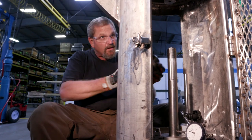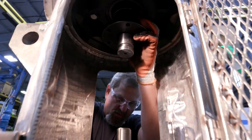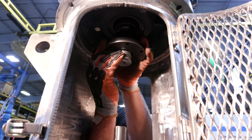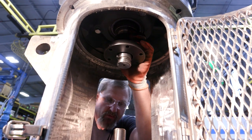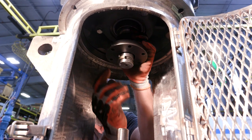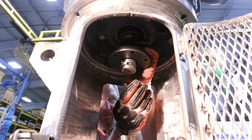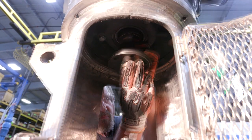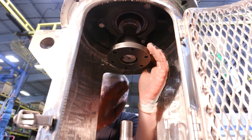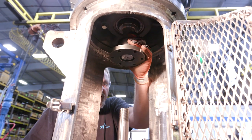The first part to assemble is the motor hub — install it so everything slides up freely. Install the motor key and get it started in the slot. You can hold the motor key in by turning backwards on that. Now take the split rings where you marked the X and make sure the X is up. Place one split ring over the keyway and then the other split ring with the X up on the other side. Once installed, the motor hub slides down and carries the thrust load — the split rings carry the thrust load.